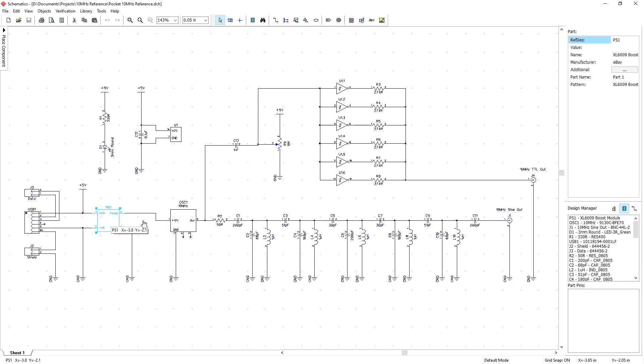Then it comes over to the power supply — set out of circuit to about 12V before we connect the oscillator. That comes out through to the 10MHz oven controlled crystal oscillator. Out of there we get our 10MHz signal. The bottom section is the 9MHz to 11MHz 5th order Butterworth filter. If I make version 2 I'll probably change this — maybe go to an op-amp solution, because this does drop quite a bit of the amplitude as it chops away parts of the square wave. The output is usable but a little lower than I'd like. I might put an op-amp low-pass or band-pass filter in a later revision. But as it is, this filter does give out a really nice sine wave, and that's perfectly usable.